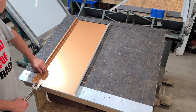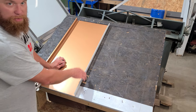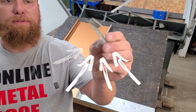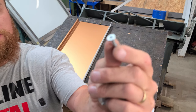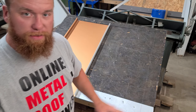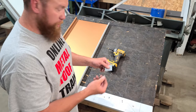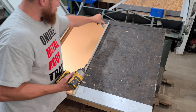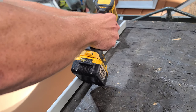For demonstration purposes, I've secured this side with a clamp and a screw up high. First, we have to clip this seam — that's what a clip looks like. There are two holes in each clip and each hole needs to have a screw. These are one inch, number 10 pancake head screws, and they sit on the clip nice and flat, so when the next panel gets installed, the screw head doesn't poke the underside of the panel and dent upward. We're going to install this clip sitting right tight against the seam, and then get our screw in.